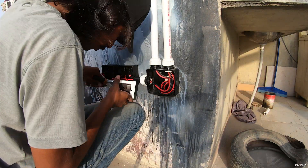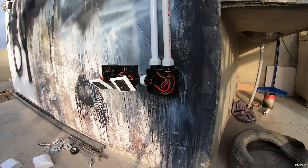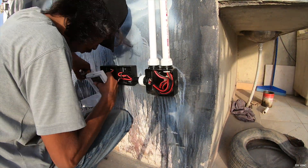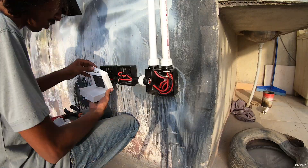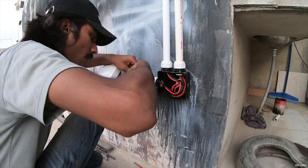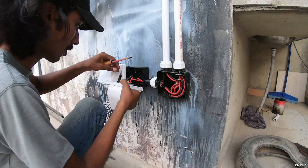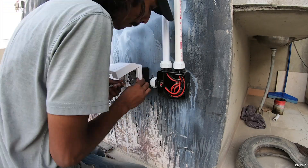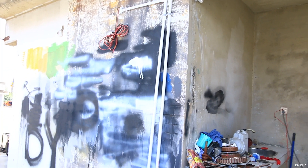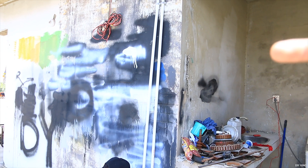The other two pairs of wires are 220 volt AC — one is the single phase supply from the grid, while the other is the load side. Besides the junction box, we also mounted two power sockets that are later going to be connected directly to the inverter's output and grid supply, in case we need to power heavy-duty tools like the welding plant or the compressor. We used two different conduits to prevent inducing AC spikes into the solar panel DC supply.